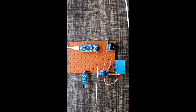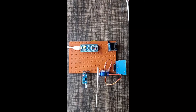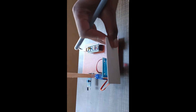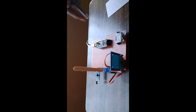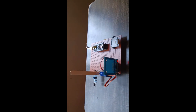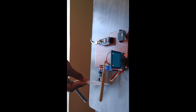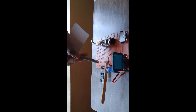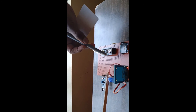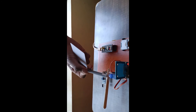The display prompts to access a card. When the customer presents a registered RFID card, access is granted and the gate opens via the servo motor rotating 90 degrees. The car can then enter the parking lot. The gate closes when the IR sensor detects the car's motion after a 5-second delay. The IR sensor sends a signal to the microcontroller, which drives the servo motor 90 degrees in the anti-clockwise direction to close the gate.